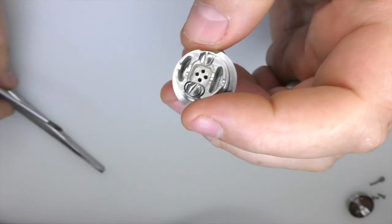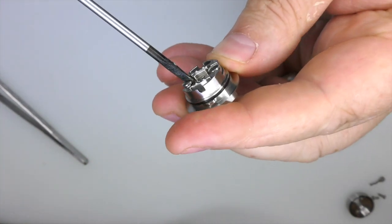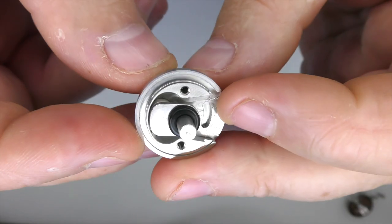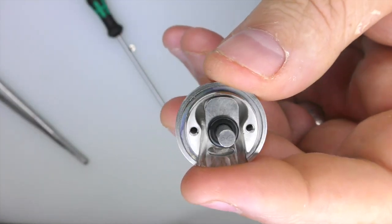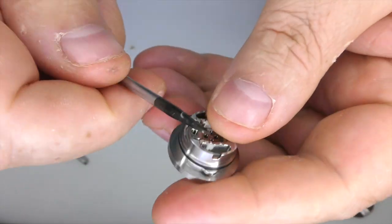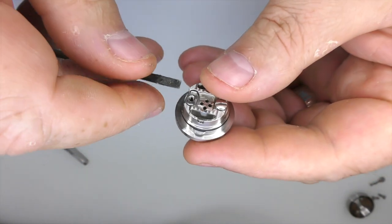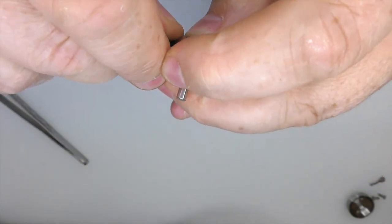That's four 1.27mm holes that we have there. This sits underneath like that and spins to adjust your airflow, making it very, very smooth. You can see your positive post there, you've got your o-ring and so on. This is like a pressure fit — it's very tight in there and to get it out is not super easy. I'm taking the flat head of a little screwdriver, stretching it across there and pushing — and it's starting to lift out.